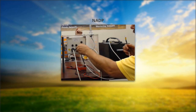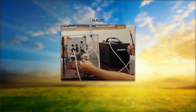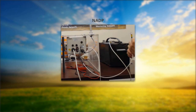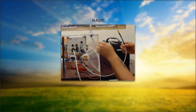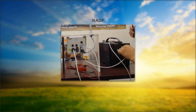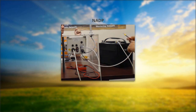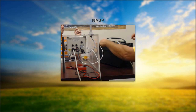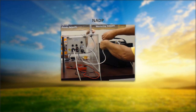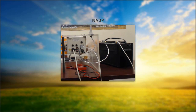I've got my negative connected, now hooking up the positive. That's good practice — keeping the live lead from the battery from shorting something else by hooking to the collector first, then back to the battery. Chris has taken electrical tape and given about six inches of play off the connector. You never want to take one lead and cross it over to the other lead with the potential of hitting positive on the negative. For a longer run, good practice would be to have some kind of inline fuse — either a circuit breaker or a fuse in line — and we can give you advice on that.